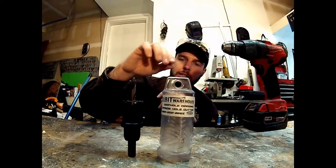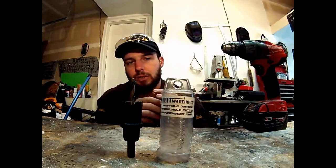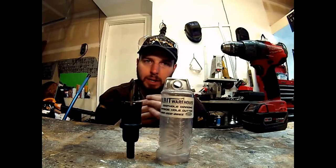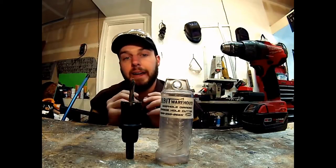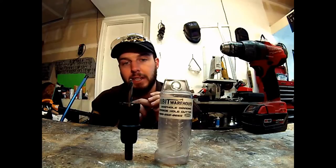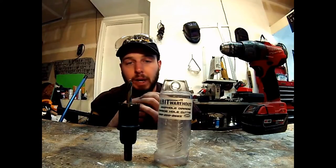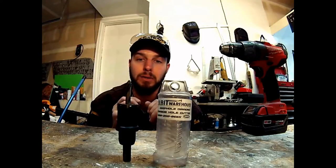Just make sure you keep it in the package, because if this gets dropped, the only problem with these drill bits is the carbide is so hard — ultra, ultra hard. If it gets dropped on concrete or steel or anything, you can chip these teeth, and that makes the blade begin to wear down just a little bit. So be careful of that. Keep it in the case, and this thing's going to punch 10, 20, 30 times as many holes as compared to a regular annular cutter or a bimetal blade.